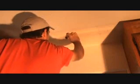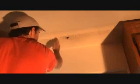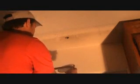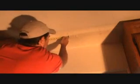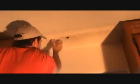And it's kind of close to that hole. There was an existing light fixture here, and this is where the wire came down. I know there's a ceiling joist over here. What I thought initially is the joist might be in the way, because I've got the can here. The can, they give you a nice little template. Here's the template for a 5-inch remodel housing, and when I measured it, it's 5.5. So that's 2 3/4 from the center. So I've got that, 2 3/4 is over to there. Now I don't know if that's going to hit the stud or not.